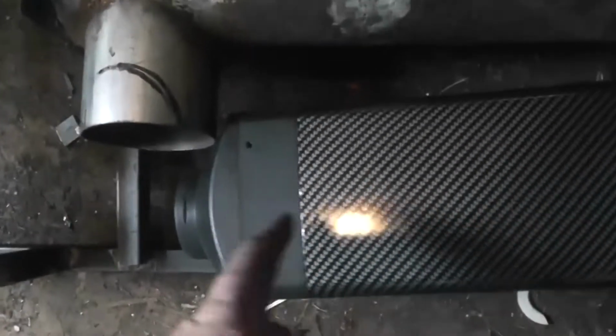So then I was thinking of putting them like this. Hot air out into the exchanger, into the house. But then your exhaust pipe is over here, and you have to get it all the way over to here. So I came up with the compromise of trying to position it like this. So heat exchanger there, 90-degree bend in, and a pretty short run over to there.